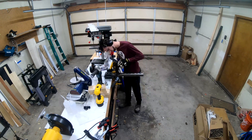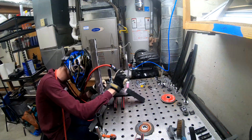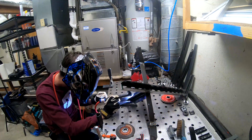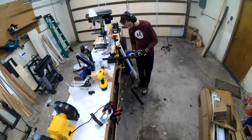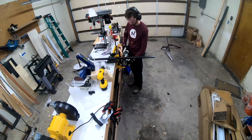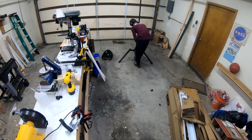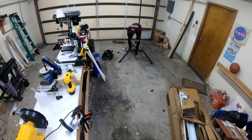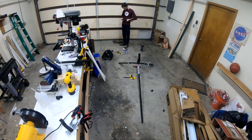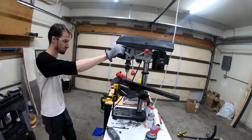I'm doing a lot of measurement with the calipers and then checking it. Here I am setting up a fixture so that I can weld everything, and I'm checking it for levelness. I level my welding bench so I can use that to check and make sure I've got everything set up right. Then I tack-weld it in place, and then I run beads down the seam of that back piece. Here I am actually cutting out the set of legs — I'm going to use three legs. These are going to screw onto those leg attachment brackets that I just added to the launch pad, and this will let me disassemble the whole thing and put it in my car. I'm holding everything together with C-clamps and using a hand drill with a fine drill bit to mark out and pilot hole all of these so that they'll all line up. Then coming over to the drill press to drill the holes out to size for an 8-32 through bolt.